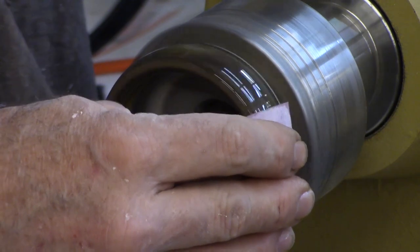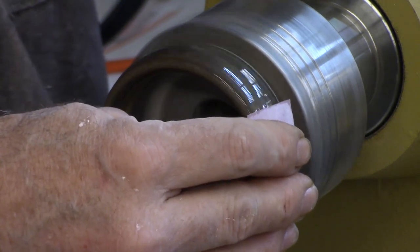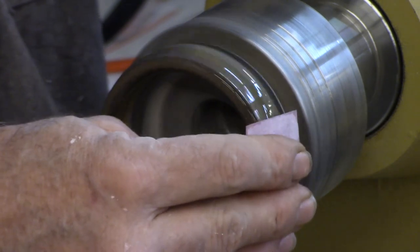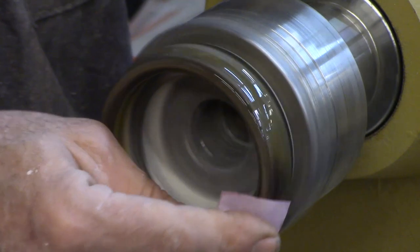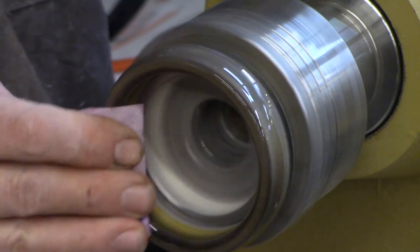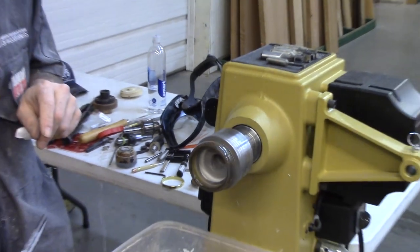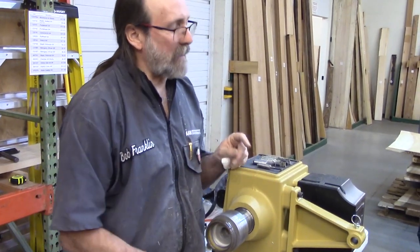The lathe speed does matter. If you increase your lathe speed, you're glancing over the surface more. You're not digging in as much. So it basically took that grit from 8,000 to possibly 10,000 now. You follow me? Now that's my personal theory, and I think it works good doing that. So I'll advance about 50 RPM or so for a count of 10 before I move to the next one. Then I'll do my count of 20 again, and then I advance it again, another 100.